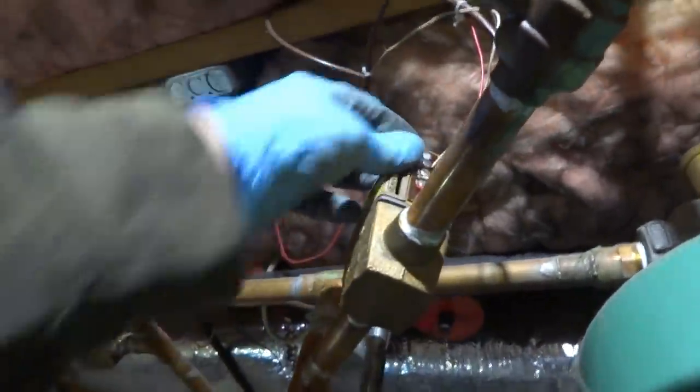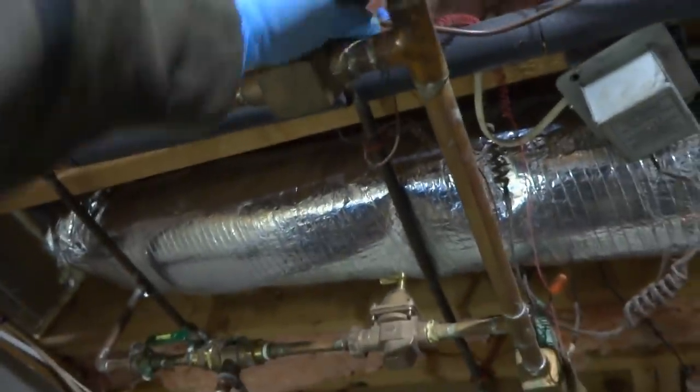It's the last purge. We can run it. We gotta open up all our ball valves. Reinstate the heads. Zone valves take 90 seconds to call, a minute and a half. But it will fire up for the... this should be already bled.